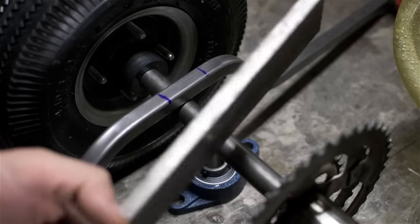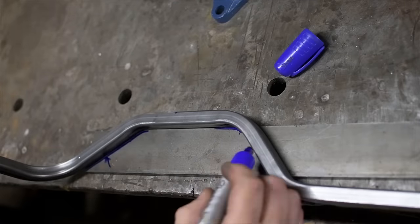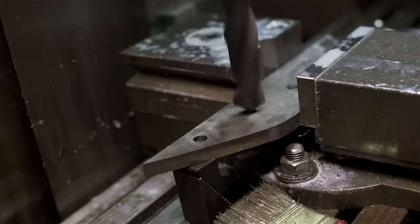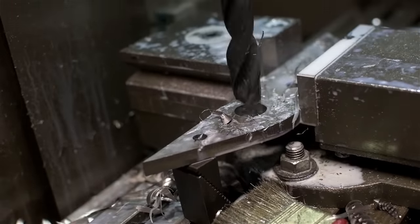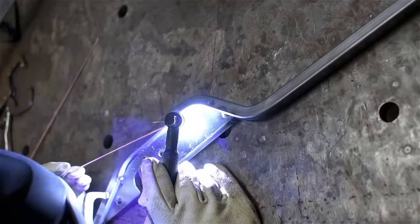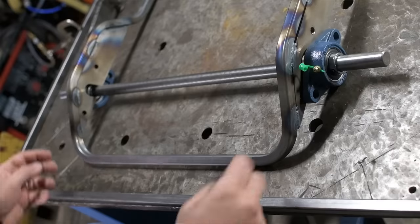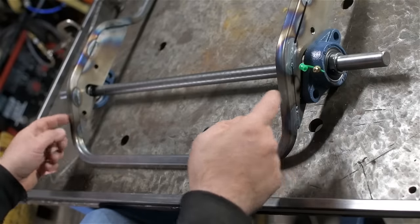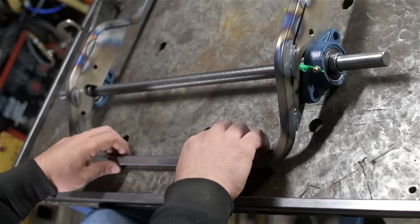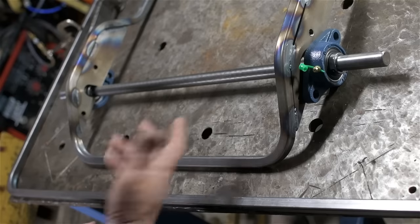Now the bearing plates. I'm going to chop up a couple pieces of cold-rolled steel, put some holes in it, and weld it into the frame. I've got both bearing plates welded in. Once the bolts come out of the bearings, the axle can drop right out of the bottom. I want to make a second piece that adds structure to the frame and gives me attachment points for the saw and brake caliper — flesh the frame out a little bit.